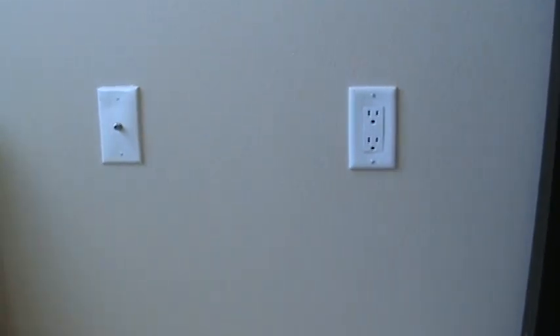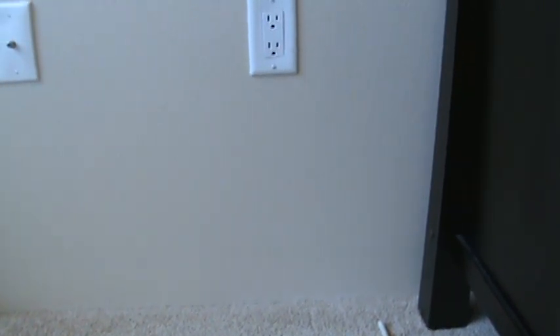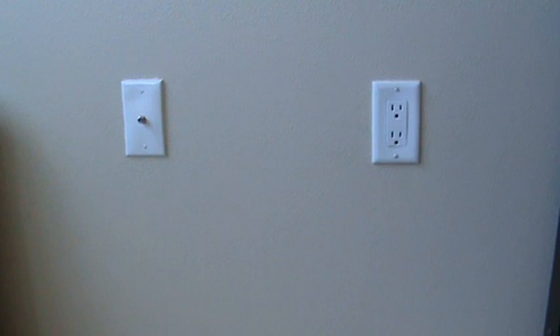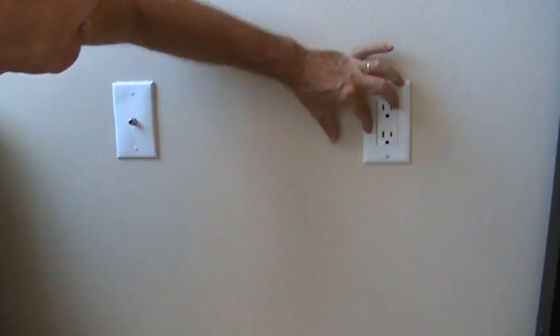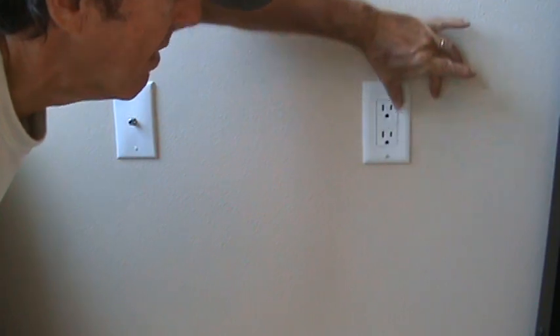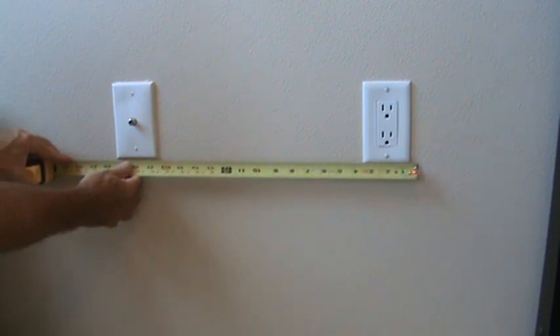Here's the other thing — you see where that is going to go. Here's a plug and here's the cable for the TV. Now I know that there's probably a stud either right there beside this box or right there. The same thing over here is probably going to be right there or right there, because the studs are probably 16 inches on center.